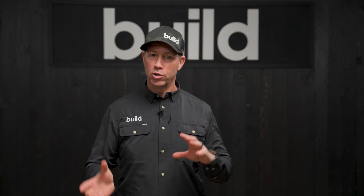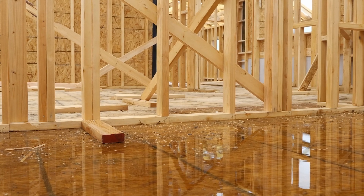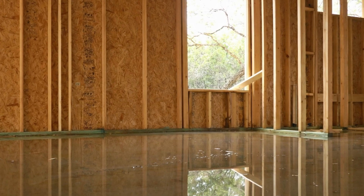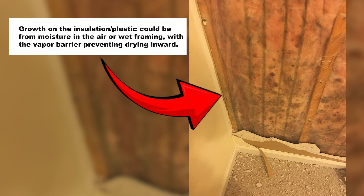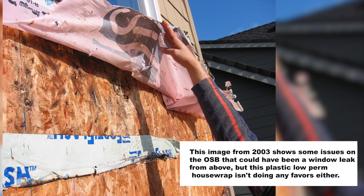Here's the genesis for this. When I used to work in the Pacific Northwest, I was building houses in an incredibly rainy climate where it would rain almost every day during framing. I was building houses on a crazy fast schedule where they didn't always really dry out before we moved on to construction. A lot of those houses had a Visqueen plastic vapor barrier on the inside and a pin-punched low-perm house wrap on the outside.